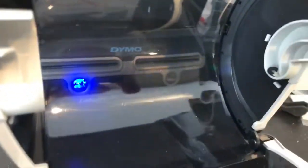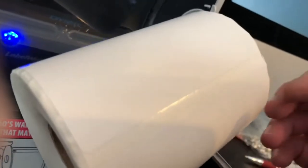I think what was happening is the spindle was tilting, and as the labels would go through, they'd hit this little spot — there's a gap on these labels right here — and because it was at a slight angle, the machine would think there was no label in it and kick it out.